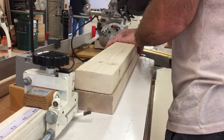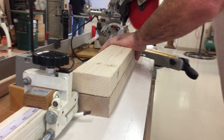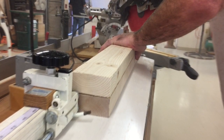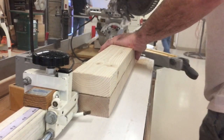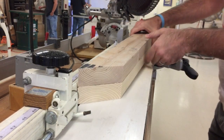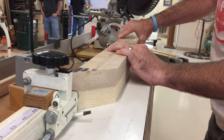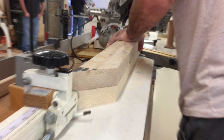I used three feet for the rails and then I'm going to put a 30 degree angle on each end. If you don't have a compound miter saw, no problem — you can do this on a table saw or with a hand saw. There are a lot of different options; I just had access to this equipment which was nice. As you can tell I'm stacking these, which makes it a lot easier to make sure they're the exact same size.